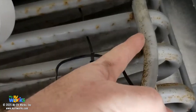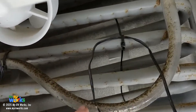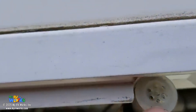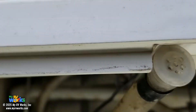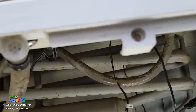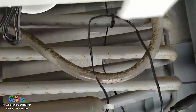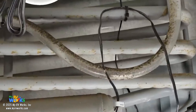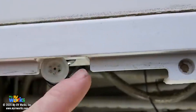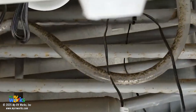While we're back here, let's look at the drip hose. I like to put a little P-trap in it to collect the condensate — some people do, some people don't, but I think it makes a lot of sense. Make sure you have the little insect cap on the back, or you might get critters in your refrigerator. The reason I use this drip trap is because the other end of this hose actually goes to the drip tray inside the refrigerator. If there's no P-trap, humidity or warm air from outside can work its way inside the refrigerator — kind of like an air breach. By putting a P-trap in, you get a low spot that holds water.